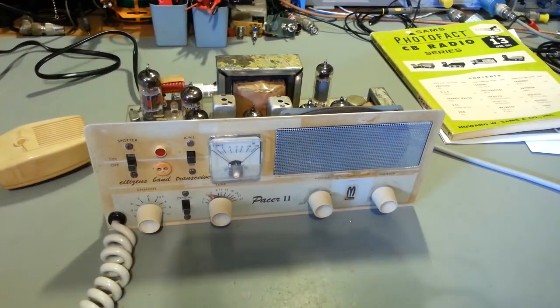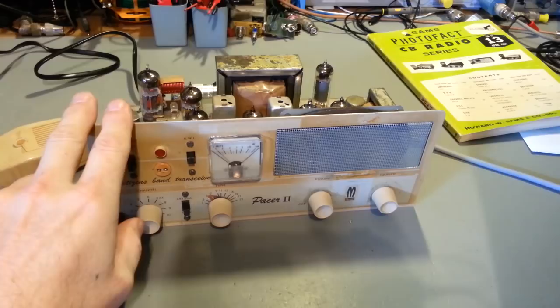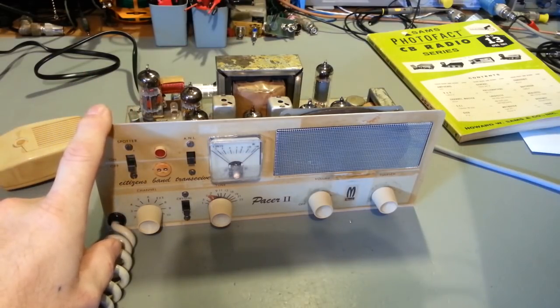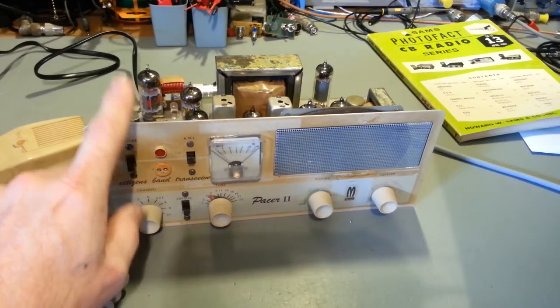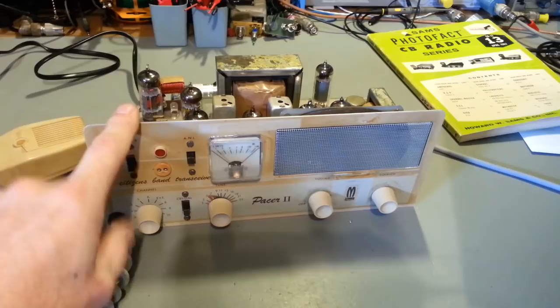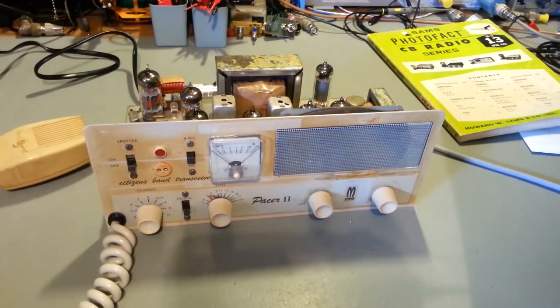The transmit crystal, actually, I'd have to look. I've written down some of the frequencies here. What did I have? So, like, for channel 19, the receive crystal is 27.64. So it's 455 kilohertz higher than the actual channel you're on. And not the transmit, that's the receive crystal. The receive crystal is 455 kilohertz higher. And then the transmit crystal is a 13.5925 megahertz crystal for channel 19.